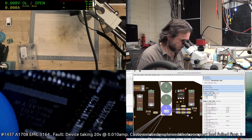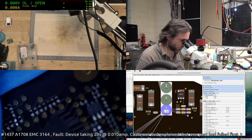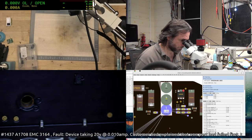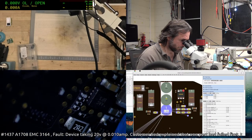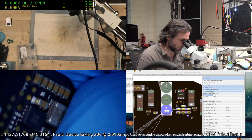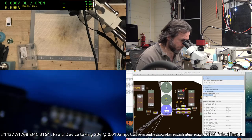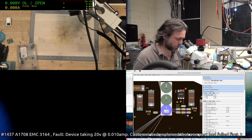Hey, how's the moth? How's things going in your dark world? Yeah, that SMC looks pretty good to me. You know how I feel about replacing chips that look perfectly good. It's not really something I like to do, particularly if the machine has come in with damage. Like, if a machine has come in with liquid damage, then you really shouldn't just arbitrarily replace chips if they don't have any sign of damage on them from the liquid or whatever. It's quite possible that secondary issues will occur and the chip got knocked out because of something that was damaged with the liquid damage.